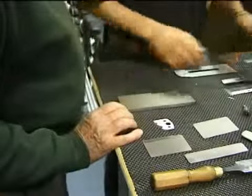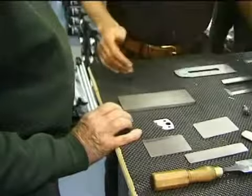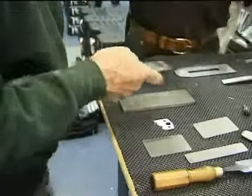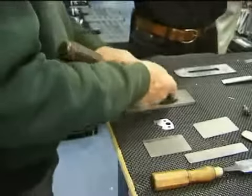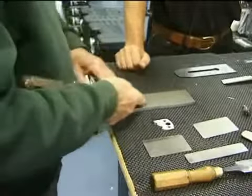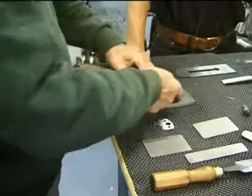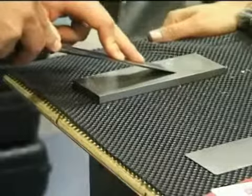So I've got a bit of fluid on there, let's put a bit more on. Just give that a little wipe over there and get a feel of the way that bites. Very little pressure. Softer and slower, that's better. Much softer, just let the diamond do the work. Feel that biting?